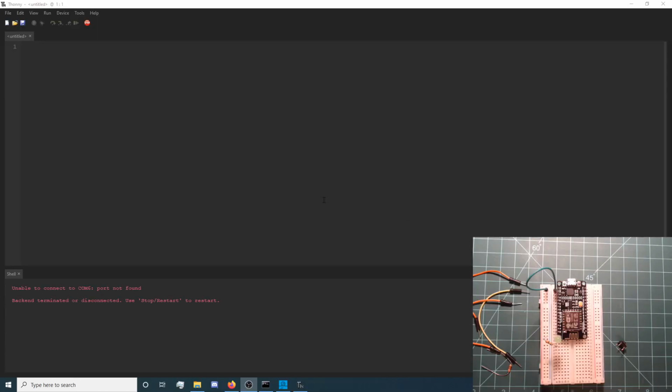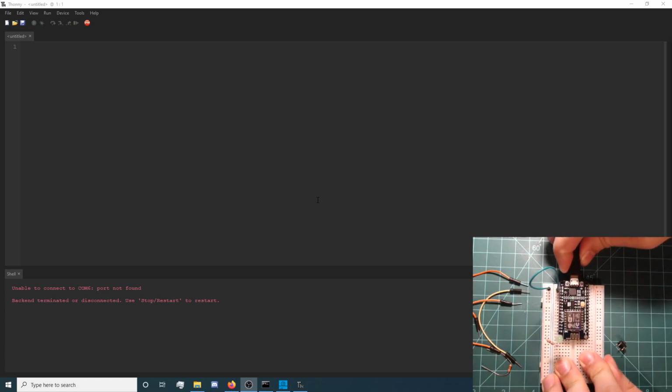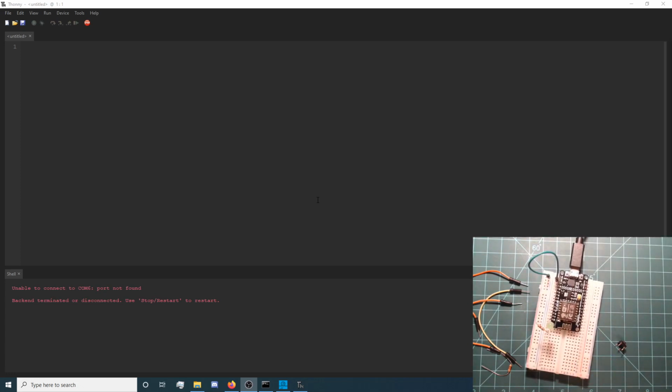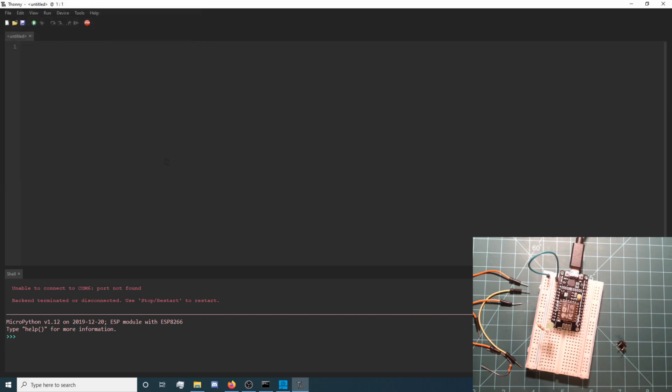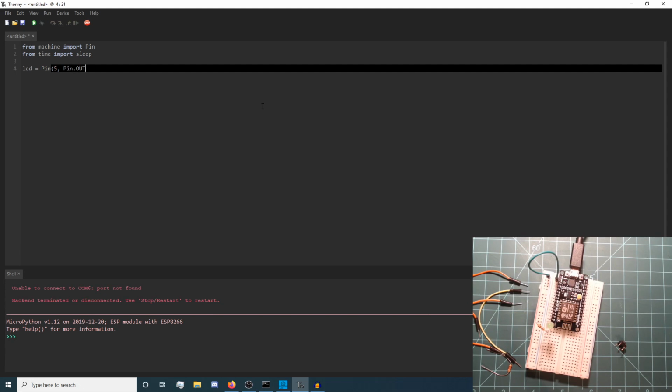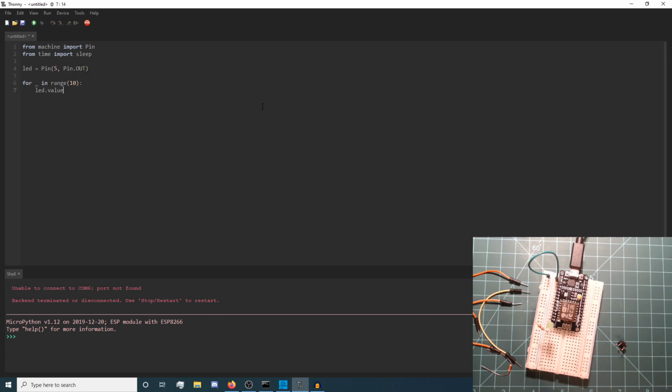On your computer, open Thonny and connect the NodeMCU with a microUSB cable. Press the stop button to get a REPL. If you have issues getting the REPL to appear, make sure that your interpreter and port are set correctly. Enter the following code into the editor. You can also copy it from our guide or gist links located in the description of this video. This code will blink the LED that you connected to GPIO 5 10 times.